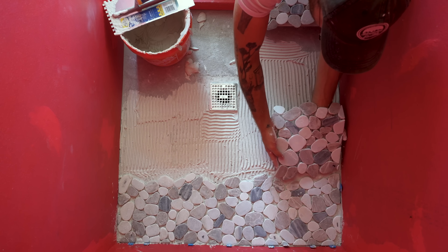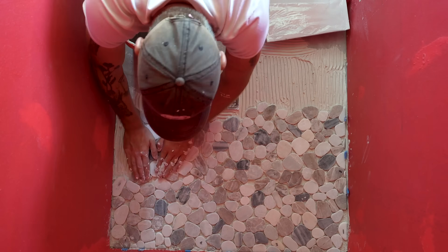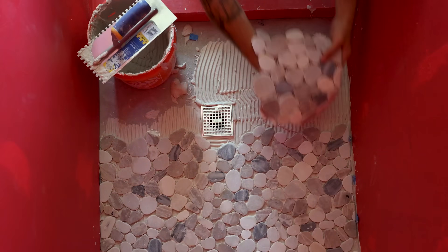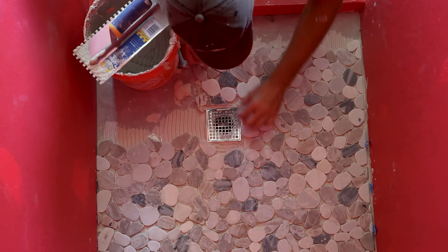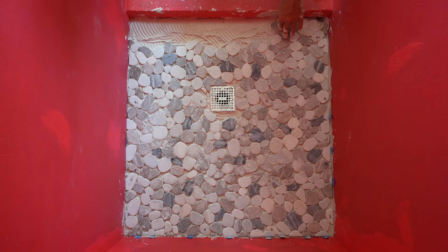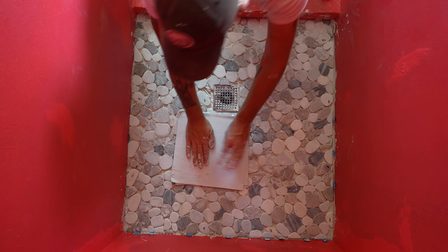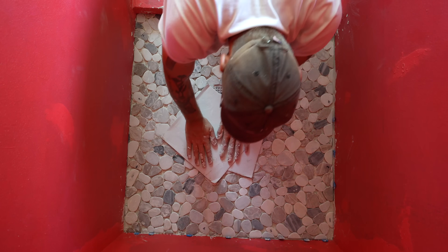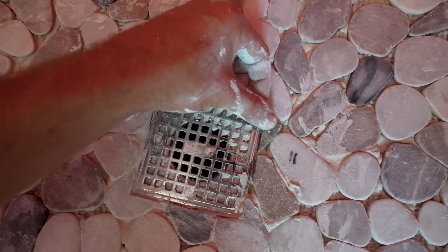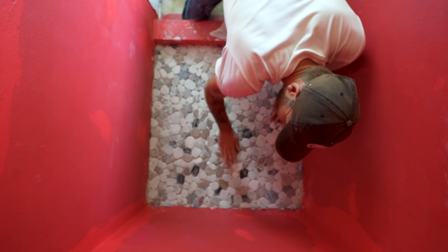I'm going to try and lay these as flat as I can, then place it and give it a wiggle. You want to press down a little bit, but not too much because you don't want a lot of squeeze-out — that'll cause a lot of cleanup later. I'm using cardboard here, but you could also use a grout float to press down and make sure all your tiles are level with each other. Everything is sloping towards the drain, but we just want to make sure no stones are popping up. Here we're at our final row and if our template is successful all of these pieces should go down with no problems. The template worked great for the perimeter and the individual stones around the drain went down with no problem as well. I'm really glad I went with this template method — I was able to cut everything in one go and install it all in one swoop. Now I want to clean this thin-set off the face of the tile before it dries.